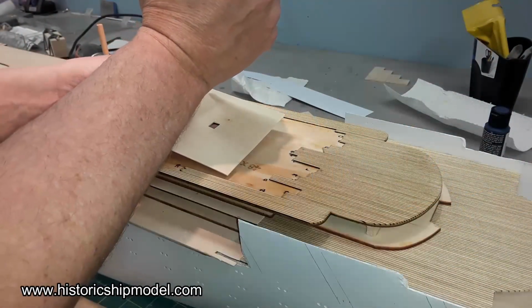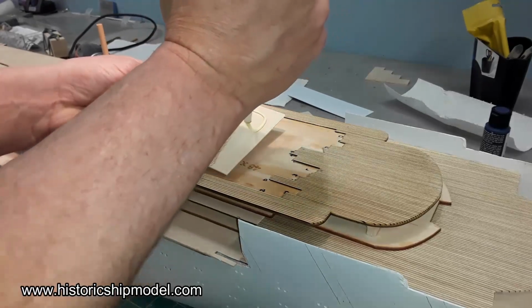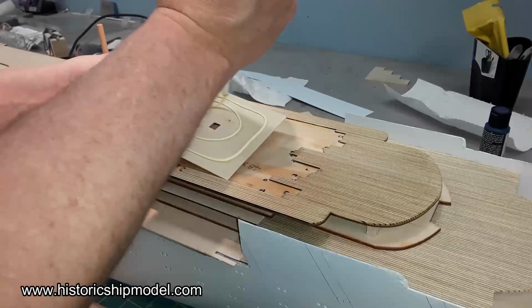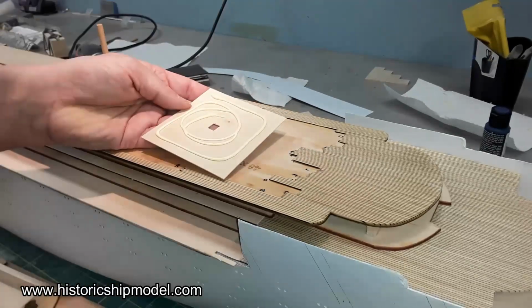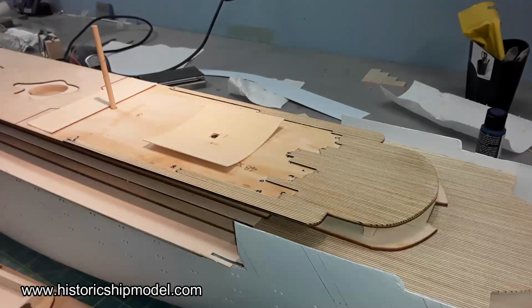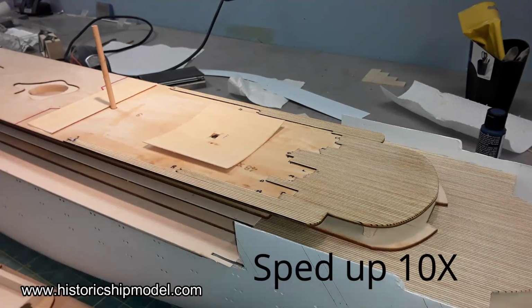To take up the space where these planks aren't run, I'm going to use some cheap basswood of the appropriate thickness. The glue's moisture can cause the wood to swell and curl, so if I spray water on the top of this, it'll curl back. In this application, it's not important because I'm going to be clamping this down, but it looked like a good place to demonstrate this.